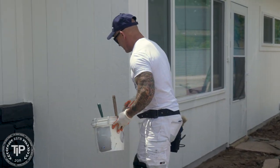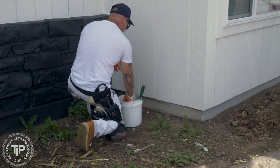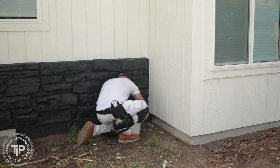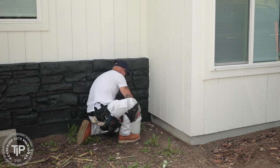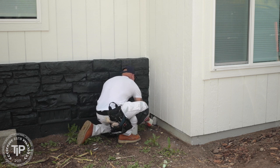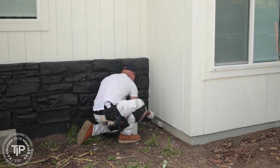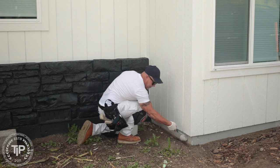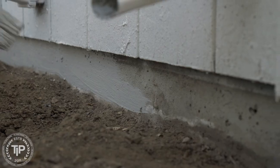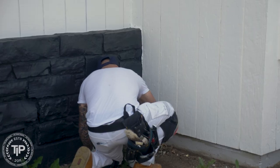You want to get your paint down below the dirt line. Once it dries, we'll just backfill that dirt. We've got drips of paint, black overspray, white overspray — we want these footings to look really nice. If you've got room for a four-inch roller you definitely want to use a roller; it's a lot faster and easier. If you can't roll it, you're just going to have to brush it. I don't want to get my roller into dirt, so I'm just going to brush these here.